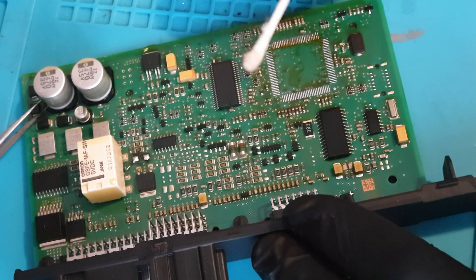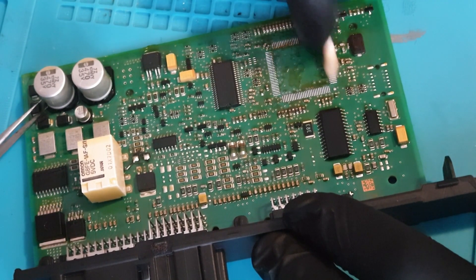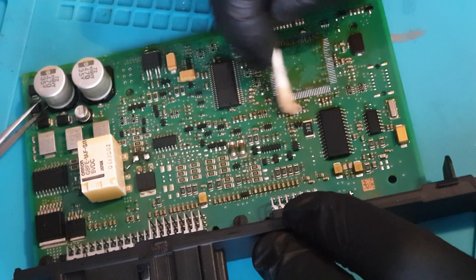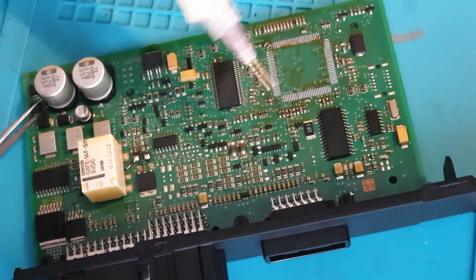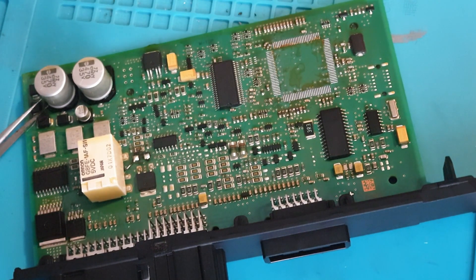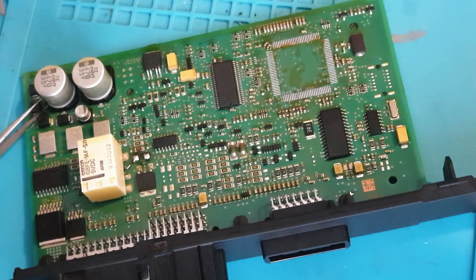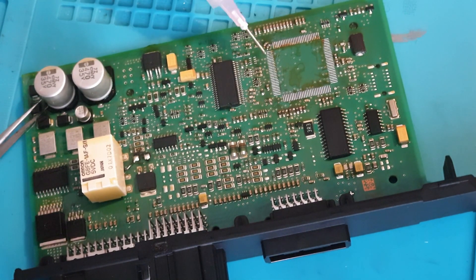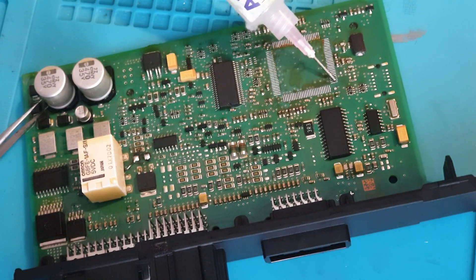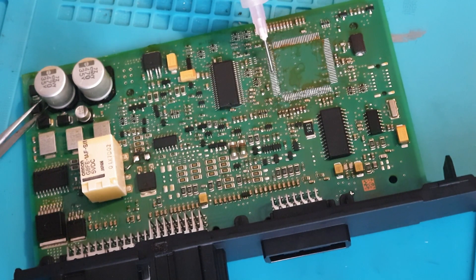You really should have your extractor fan going while doing any soldering, particularly when you're using flux. Now, some people may put fresh solder back on the pads and then put the chip back on top and let it sink into the new solder — that's one way of doing it and there's nothing particularly wrong with it. But it can sometimes make it difficult for the chip to sit down flush all the way. So what I'm going to do in this case is just put a bit more flux on — some fresh flux, not a lot, you don't need a lot.